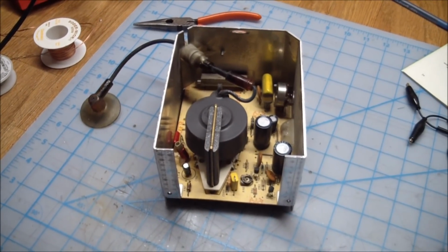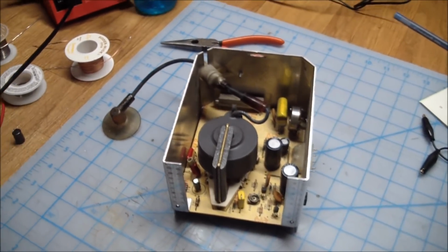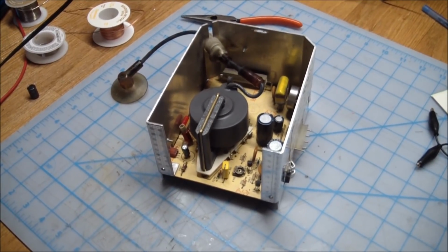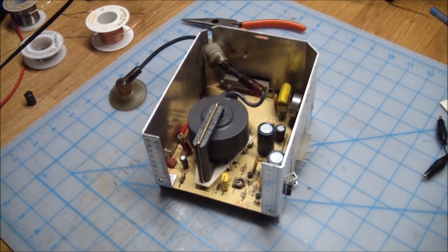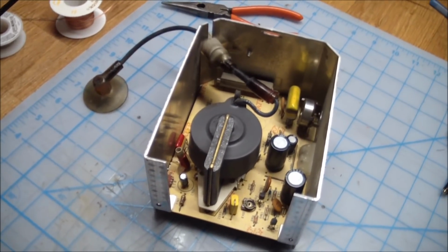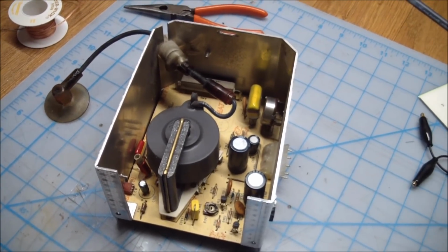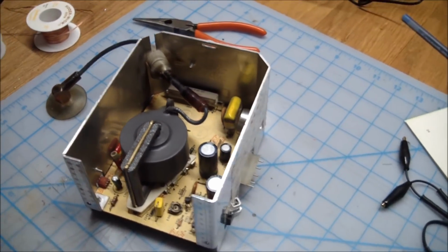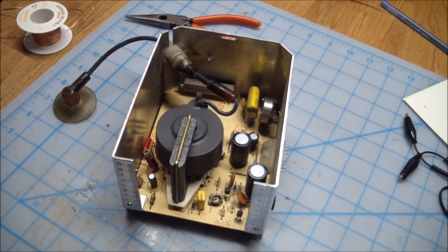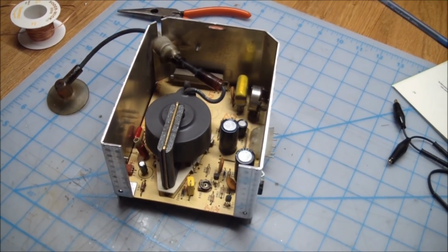Well, it still didn't work. Same thing, I heard chatter. The spot killer light wasn't on, but there was no display on the screen. So I took out the high voltage cage. I measured the input voltage, which was exactly 40 volts DC as required, but all of the voltages it generated were low. Anywhere from 5 to 20% lower than specified.